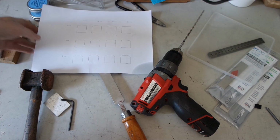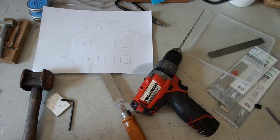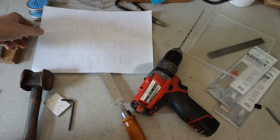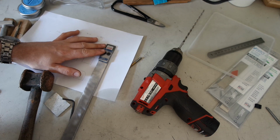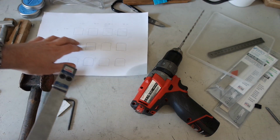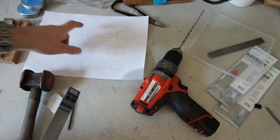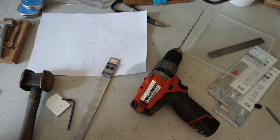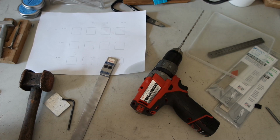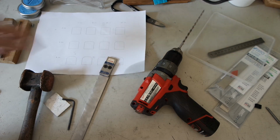Now there are some different geometries I've seen recommended. I've read somewhere 300 millimeters, which I think is the supplied radius on the tool bit. But others mention radii of 80 or 70 millimeters. And there's also a corner radius to prevent digging into the workpiece. That's something I will have to experiment with. But obviously I can increase radius much easier than decrease it. So I'll start with a low corner radius and a big main radius.